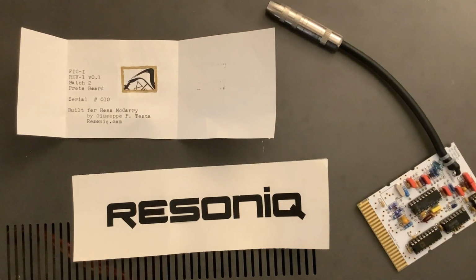Then there's also something else I'll have to show you to do with the frequency range that this thing can sample. You're up to 50 kilohertz, or 25 after the Nyquist theory is applied. That will come into play because the Mirage does have its idiosyncrasies and it does kind of get a bit confused. I'll show you that later on, it's quite interesting actually how it works, but there is a hidden parameter that we need to talk about, which is parameter 93. So that's next up, cheers.